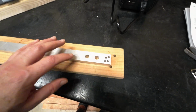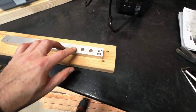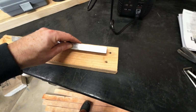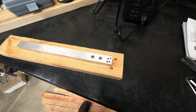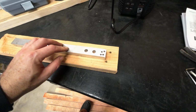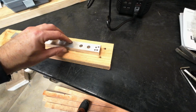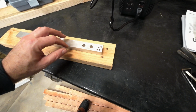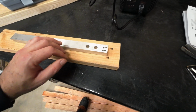And you're probably thinking, oh, aluminum, come on, that's got to be the easiest thing to tap. But this is MIC 6. It's pretty hard, pretty gummy. It's not your typical like 6061 or like a pretty easy to get through aluminum. This one's a little bit tougher. I've broken bits on this. I've had issues with the milling machine with it. You got to have just the right speeds and feeds. So it's actually a little bit temperamental.